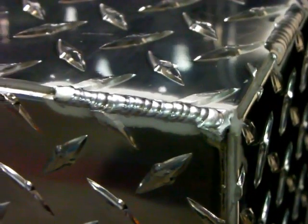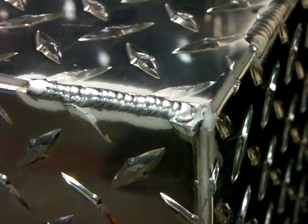Same amount of time, I'd have welded a foot with the helium at that same amperage. And even at that, it's kind of cold. So there's a difference — that is the point. Not that we couldn't weld this with straight argon; you obviously could. But what if this were quarter-inch or three-eighths-inch thick aluminum? You need all the help you can get.